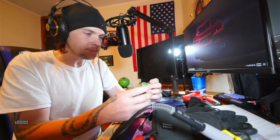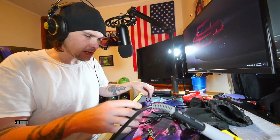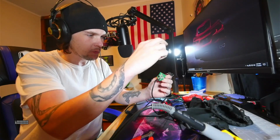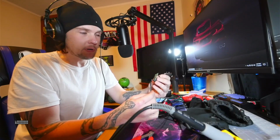But while I was shoveling, my gloves got a little bit wet, and I felt a little tingle on the back of my hand, and she shut down. Actually, no, I felt the tingle, and I kept shoveling. When I got inside, I physically turned these off. They never stopped working, but then when I tried to use them today, they would not turn on. So I came home, plugged the battery in, put the voltmeter on it to test. I couldn't get power. So I just kept working backwards. I had power here, but on the other side of this chip, there's no power. So somewhere between these connections from the battery and out to the wire, something's messed up. So we're just gonna chop it out, see what happens. So let's do it.